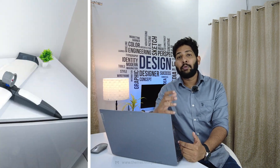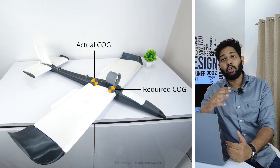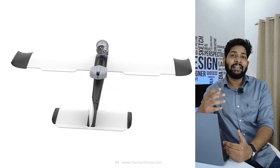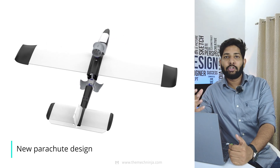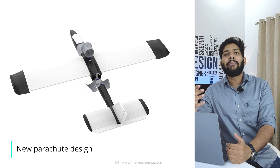Let's move on to the design problems I found after assembly. The big problem was the tail was too heavy — even with a larger front battery, I couldn't achieve the proper center of gravity. Originally the parachute was meant to be mounted in the tail section, which made things worse. So I shifted the wing further to adjust the center of gravity, and redesigned the parachute system into the fuselage. Mechanically it works like the previous version, but it's more compact.